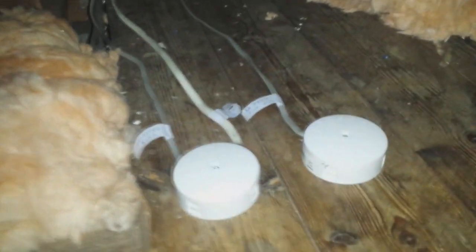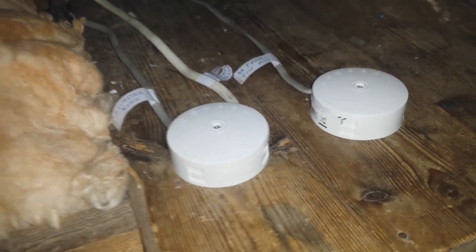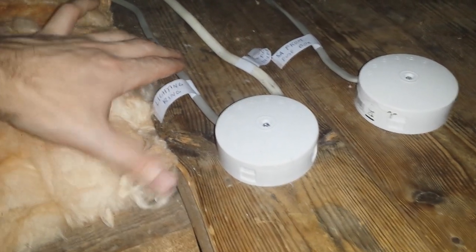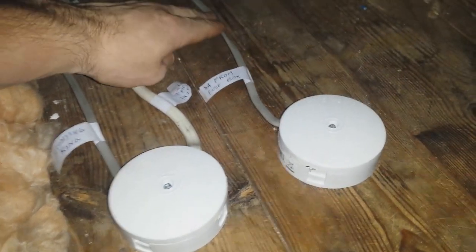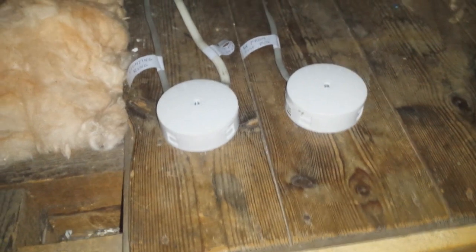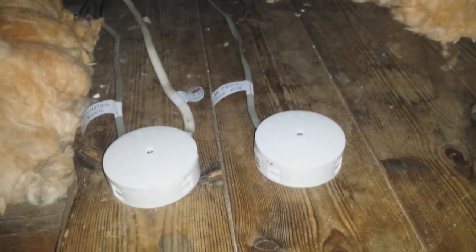I'll briefly show you where that wire actually goes. Here in the roof of the house I've moved the junction boxes for the lighting circuit so they're easier to access. The wire on the left leads to the actual lighting ring and to all the lighting fixtures throughout the house. The wire in the middle comes from the inverter — as you can see the inverter is currently supplying power to all those lighting fixtures. The wire on the right is the original 5 amp mains feed from the fuse box, terminated in a second junction box, but should I ever need to swap it back it will be quite easy.